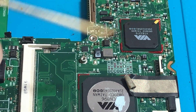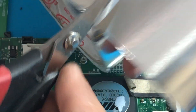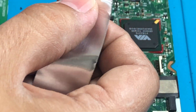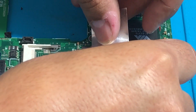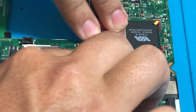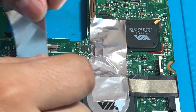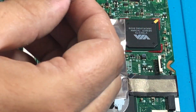If you have a sensitive component around it and you don't want to hit the motherboard, buy yourself a foil tape — these are like from air conditioning type. Just cut the foil tape into different pieces. Your motherboard has to be off, all the batteries have to be removed, and you can easily isolate the motherboard. Once you isolate everything, some components you don't need to isolate — nothing happens as long as you don't put excessive heat.